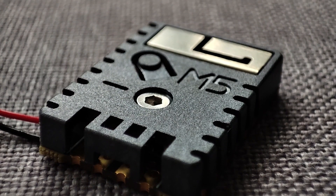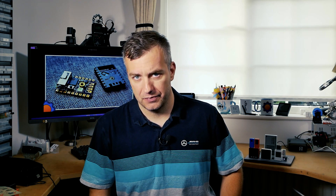But if UI Flow or MicroPython isn't really your thing and you want to go back to C++, as with any ESP32 board, you also have support for M5 Stack libraries using the Arduino IDE. Just bear in mind that to do that, you'll have to erase the existing firmware. And don't worry — if you change your mind and want to go back to wireless programming, all you have to do is use M5 Burner to reflash the firmware, though a programmer will be needed to do so.